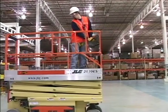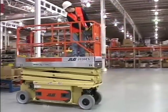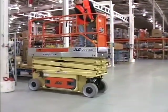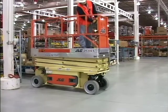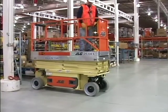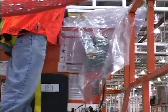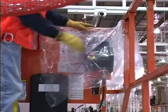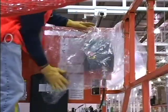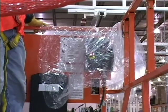To shut down and park the machine, the procedure is as follows. Drive the machine to a well-protected and ventilated area. Ensure the platform is fully lowered. Shut down the emergency stop at the platform controls. If necessary, cover the platform controls to protect instruction placards, warning decals, and operating controls from hostile environmental conditions. Remember to uncover prior to operation.